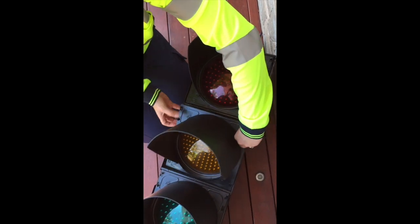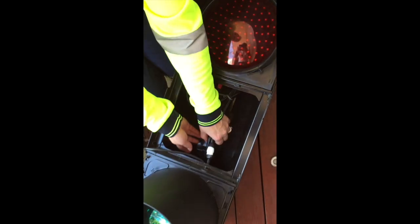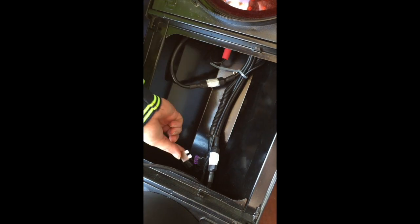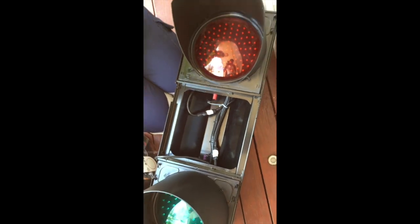Lantern fuse. In the event of no response from the lantern or no power, and the battery is charged and working, check the fuse holder for a blown fuse. The fuse holder is located behind the yellow LED module. The fuse blade used for this is 3 to 5 amps.